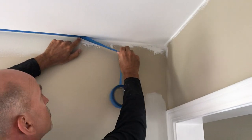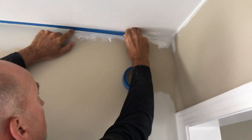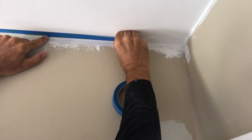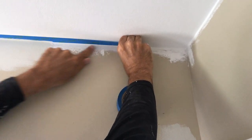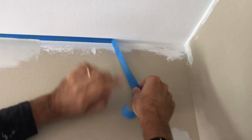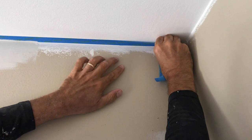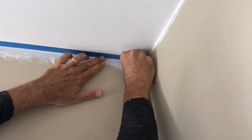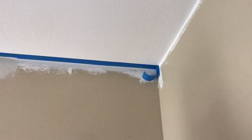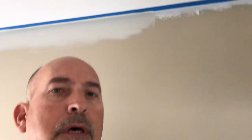What we do here is take about five inches of tape and we can manipulate it and move it, working it right into where the wall meets the ceiling. I rip the tape a little bit long, I'm lining it right up, and here is a very important part — I use a fine flat-headed screwdriver to seal the tape.